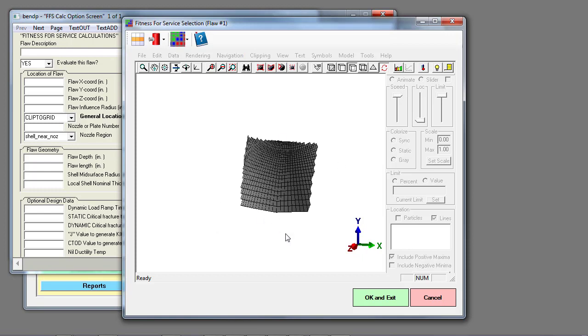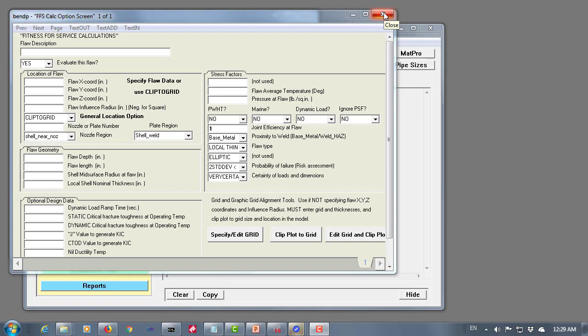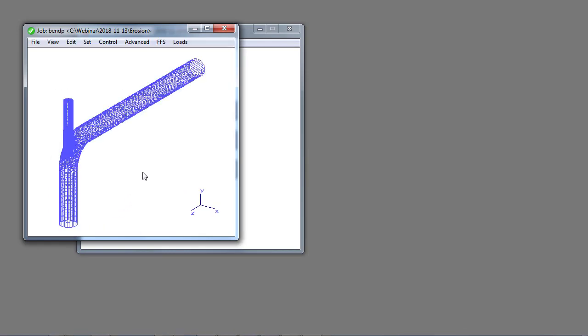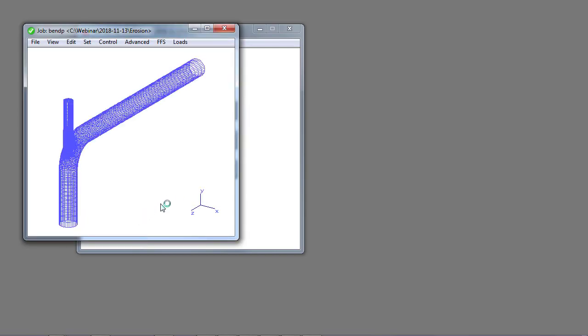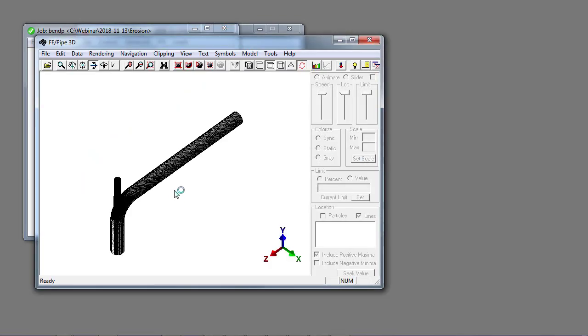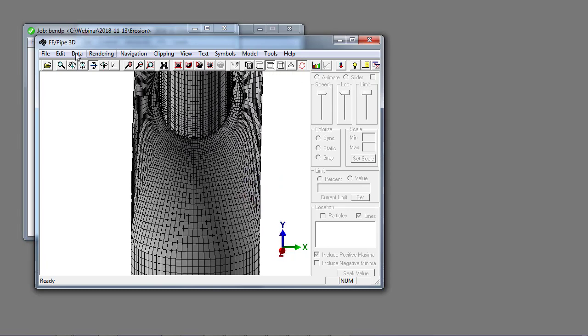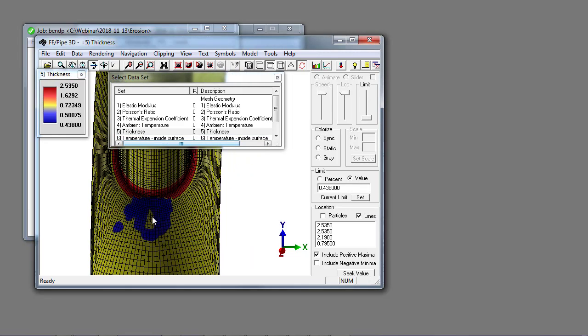There are my clipped elements with the grid specified. I can now apply the grid. Once the grid is applied, I prepare for analysis and inspect the thickness profile just as before — going to model verification, write properties 3D — and now I can plot the contour plot of the thickness measurements on the extrados to see my corrosion pattern on the backside of the bend.